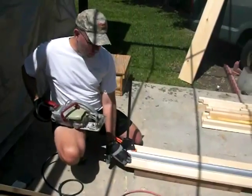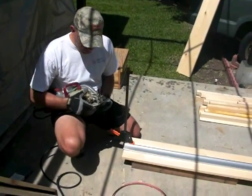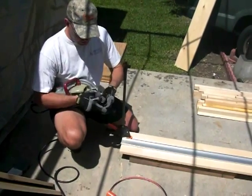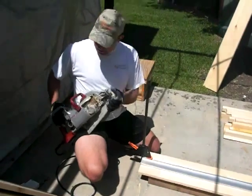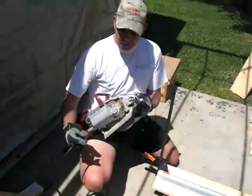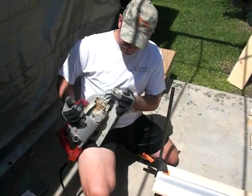Make sure you get any rocks or little pebbles out of the way so you've got a really nice flat surface to work with. I need to cut a 45 degree bevel on this. There's a little set lever and you want to rotate this out. Also notice I don't have the saw plugged in — you want to make sure when you're setting all this up, leave your saw unplugged until you're ready to cut, just for safety purposes.